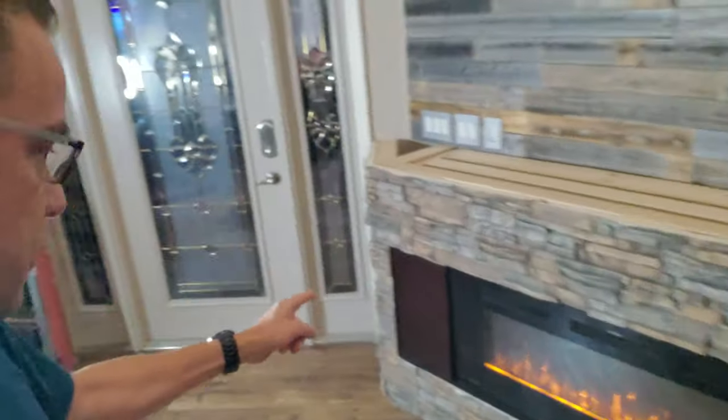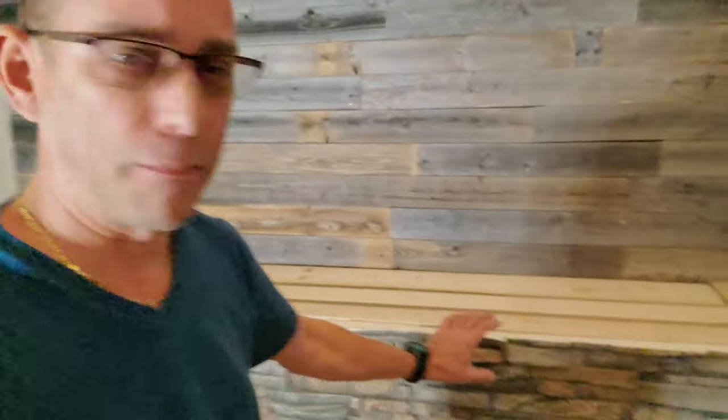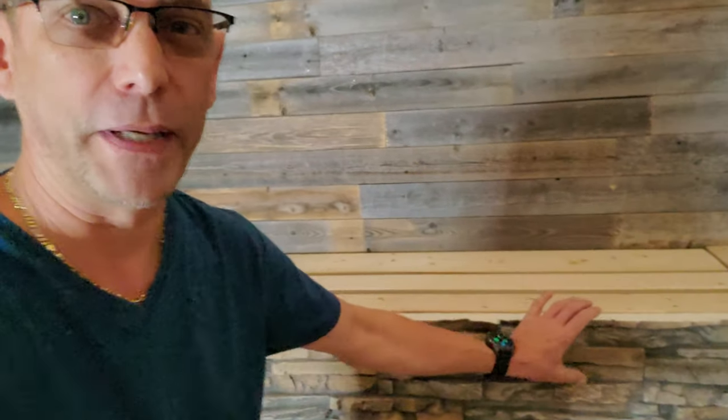And you'll say, well, why not do the seams on this? You've got a seam over here. I'm gonna hold off on that because I might have to remove these top faux stone panels when the wood beam mantle comes in, because that's gonna sit down like an L shape and come down about a 4-inch lip of wood beam. So I might have to cut those off. That's why I'm not gonna finish that up just yet. So stay tuned, I'll show you how to do the caulking next.